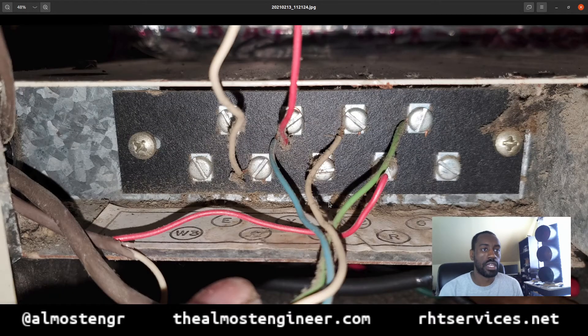Going over to the next thing — this is inside of the air handler. As you see, there are a bunch of screw terminals up here, and down at the bottom you have the labels that represent those screw terminals. The red and white wire here represent the air conditioning or air handler — these two wires go to the compressor that sits outside. When a call for cooling is made from the thermostat, these two wires get that call so it tells the compressor to kick on. The blue, white, green, and red wires here are the wires that come from the thermostat. The red wire represents the positive 24 volts, the green wire controls the fan, the white wire controls the heat, and the blue wire controls the cooling.